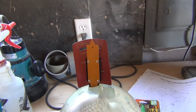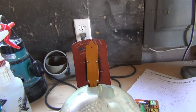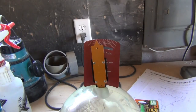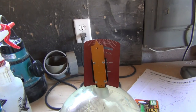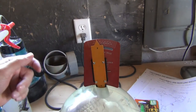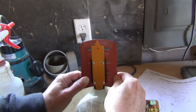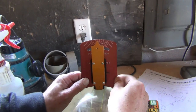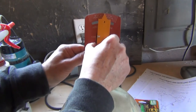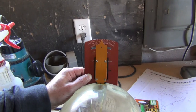I'm at my friend's house using a pitch gauge to check the pitches. Left to right, it looks like it's right at three-eighths. I'll check the other side — and that's three-eighths right there. Pretty close, off by about a quarter of a sixteenth. When I check the forward and reverse, it looks like I'm about a sixteenth off to forward on one finger, so it'll probably be a sixteenth forward on the other. So I'm about a sixteenth off forward on one and reverse on the other.